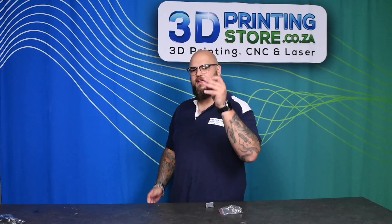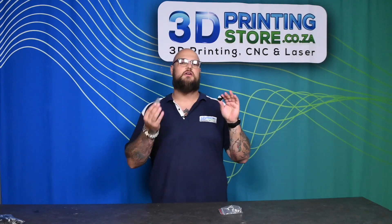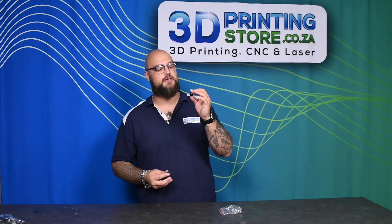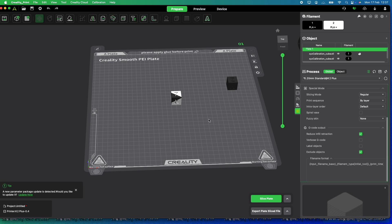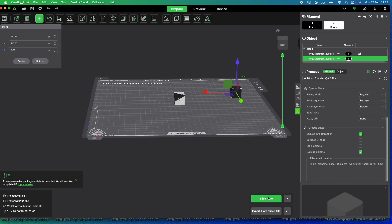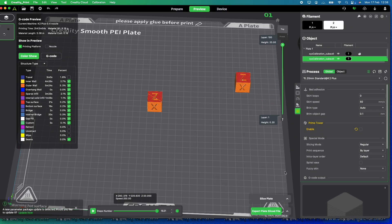What would you say if I can get this print with absolutely zero grams of wastage? That's right — it is possible to have this print with no wastage. What you can do is replicate your object in the slicing program, right-click on it, and select 'infill purge' — purge into this object. This is going to use that object as its purge vessel for the entirety of the print.